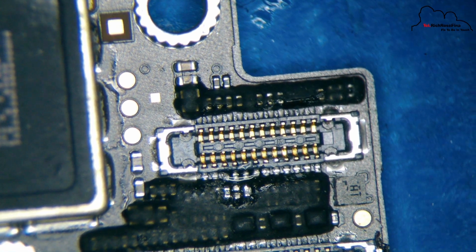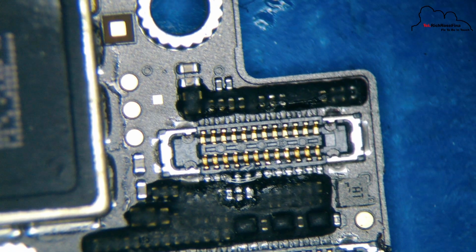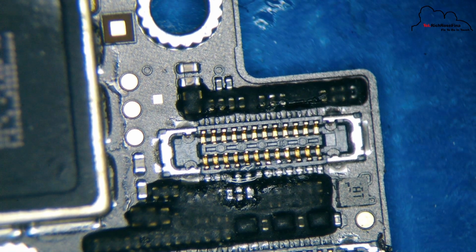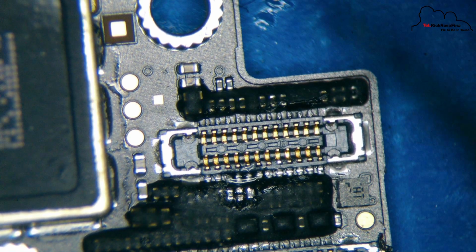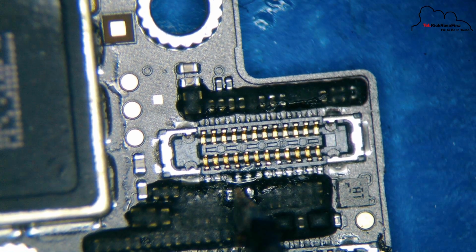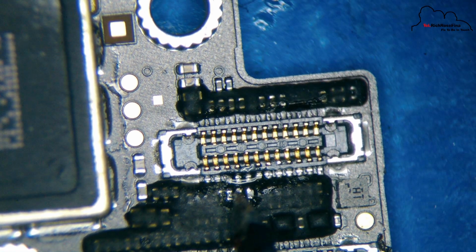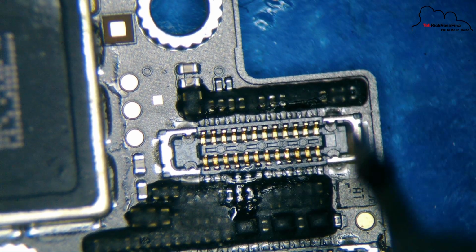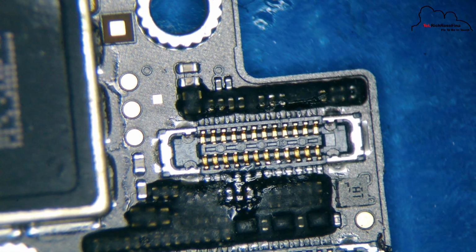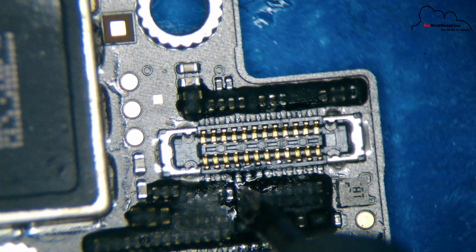Yeah. And me too, every hole they say, I resolder it in the back, and then I check it. Is a pin active, or not active? Basically, touch problems, most of the time, are from the connector with J5800. Most of the time that is where the problem is.